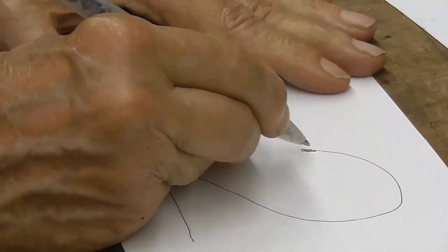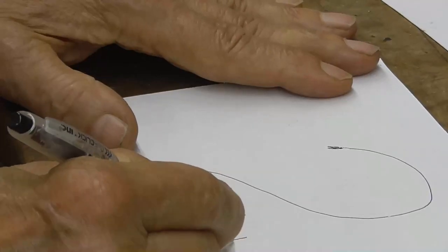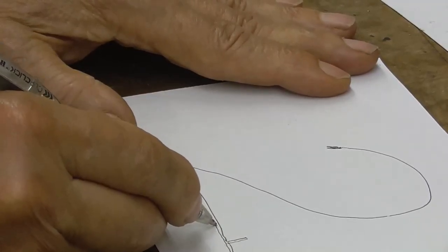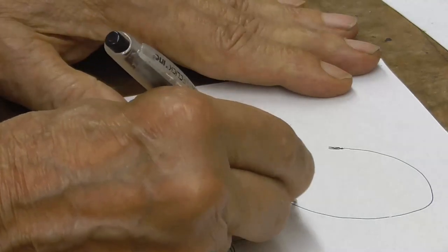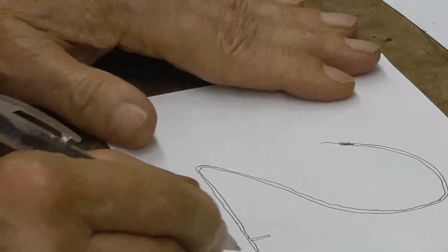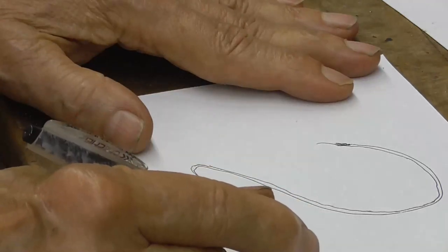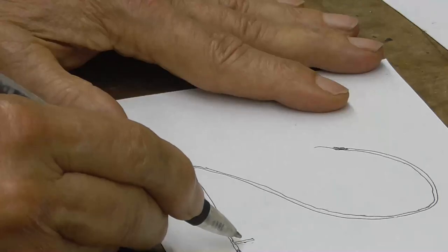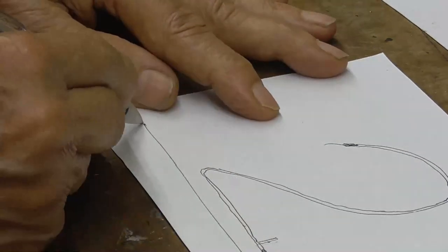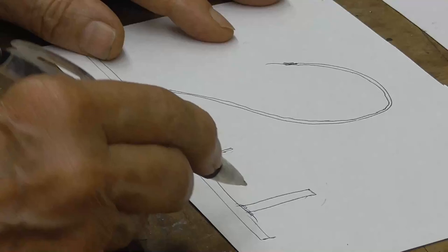this end, we're just going to seal an electrode in. On the bottom end, where we're going to put the connections, we're going to have a T, which is a fill tube. This would be tubing, of course. Sort of more or less like this. Okay. We'll have this one being the seal for the electrode, and this side tube is where we'll connect it to the vacuum system to go ahead and fill it, and then we'll heat it there, and that'll seal it off. Okay, so what we have to do on each piece of tube, we have to start off with a long piece of tube, and we put the side tube. We go ahead and seal that side tube onto there.